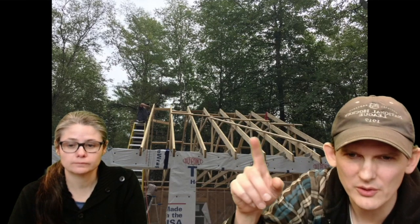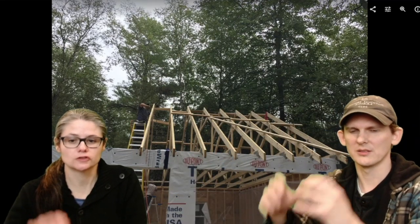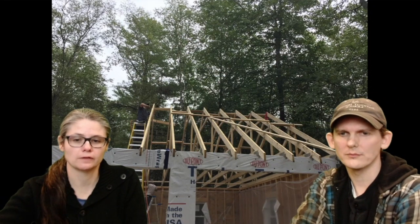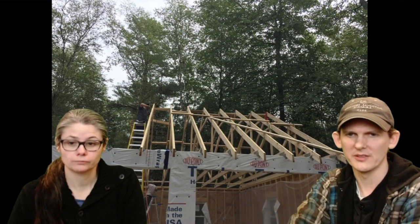So here's a couple different things. Here you can see those 2x4s that we put in, and this is what's setting the spacing here. And after you get a whole bunch of these in a row, you're going to want to put in diagonal cross braces to make sure the whole thing doesn't sway on you. You can see the 2x4s back over here on the back side, so that's spacing on both sides, and then diagonals to strengthen it. I don't know if everyone would do this, but we found it super easy to use those.